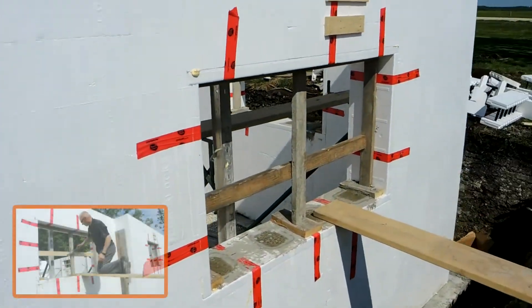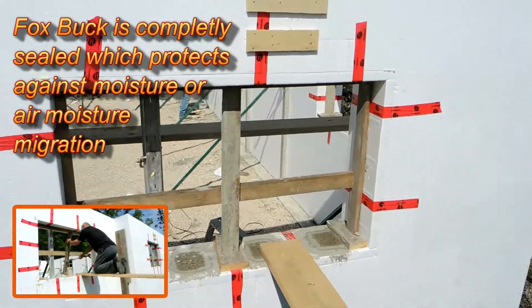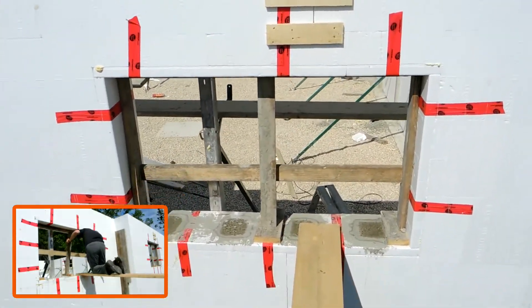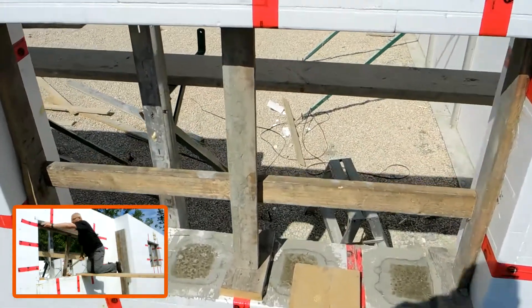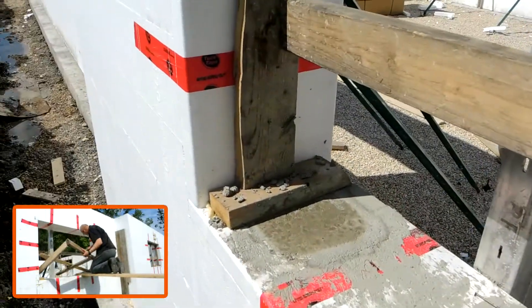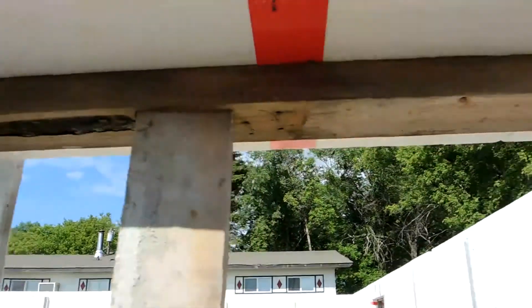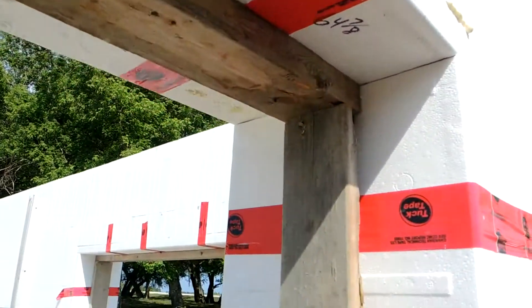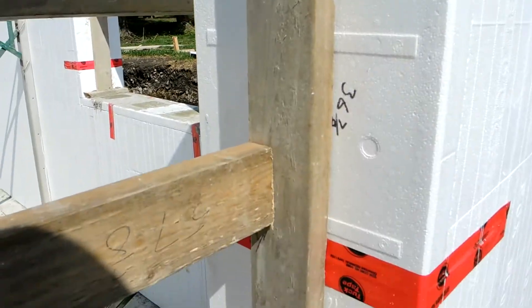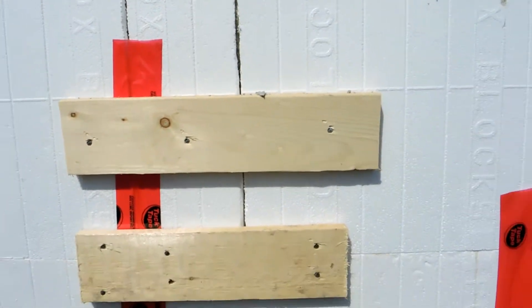Here's one that we haven't stripped yet. They just used an air nailer, which we don't recommend, but it worked quite well. There's some uprights down to some two by fours on the bottom. Just two by fours is all you really need. They put a five to six inch slump concrete and it held good.